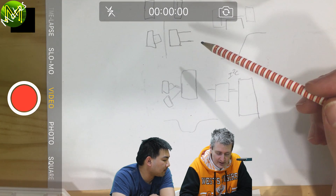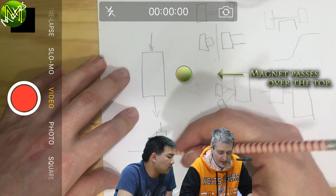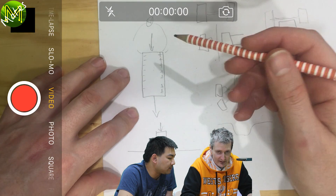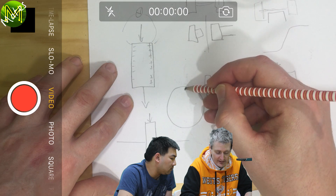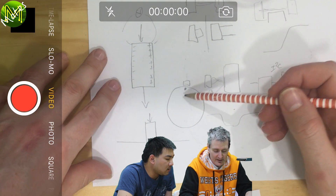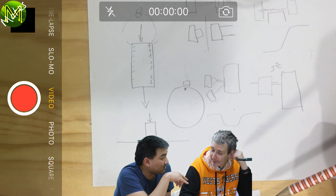There's another way you can measure rotation - the Hall effect. You've got a flat plate and you apply a current from one end to another. If you apply a magnetic field perpendicular to that, the electrons will migrate towards one side, making one side positive and the other negative, and you measure the voltage from one end to the other. For your flywheel, you place a small magnet on the flywheel and a Hall effect device next to it. You don't need to rely on light shining backwards and forwards. It's quite a good mechanism - you can buy fairly small rare earth magnets and even sink them into the plastic, though you'd probably want to put two magnets on to balance the flywheels.